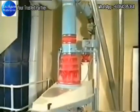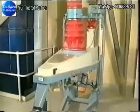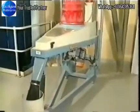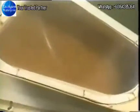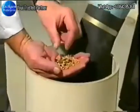Small stones are removed by the dry stoning machines. The wheat grains are lifted off the screen by an upward air current and recovered. The stones, being denser, progress up the screen and overflow into a container.